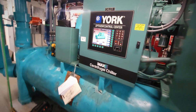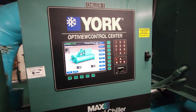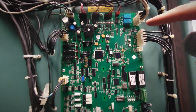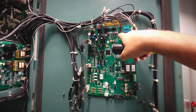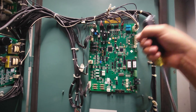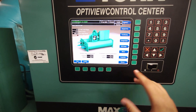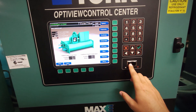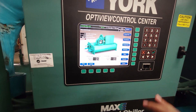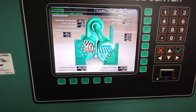We're going to hit that reset — the alarm release — and we're ready to start. We can hit clear now. There's a reset button right there; what that'll do is clear out the stored alarm. You can see up here through these LEDs: when you see K1 enabled, that means the logic board has cleared any alarms and it's telling the micro board that we are allowed to turn on. Now that we've put a demand limit in, we're going to try the startup again — hit the go button. We are looking absolutely beautiful. MTT guys, take care of your family, take care of your spouse — I'll see y'all later.